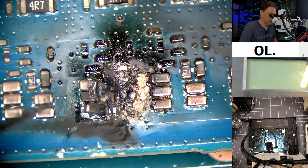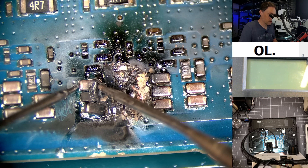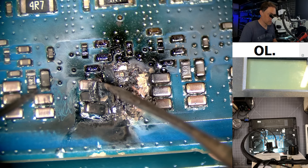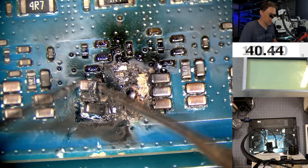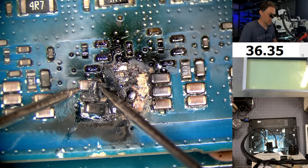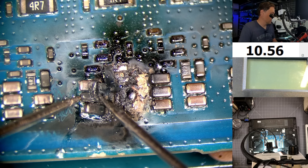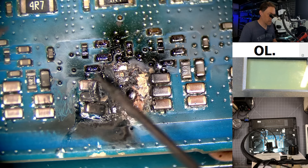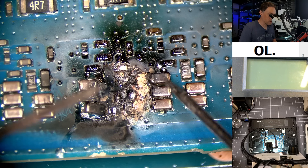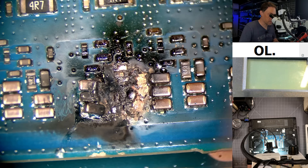That's interesting — we don't have a short here. Wow. Or do we? We don't have a short here. How is that possible? Let me try this way. We do — it's a 36 ohm short, though. 10 ohm? 9 ohm? I mean, that's still pretty high. If we test over here, what do we get? 0.2. So there's a dead short on this side. This side's not a dead short, and this is the side that looks crazy. Let's clean this up so we can take a look.